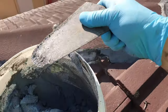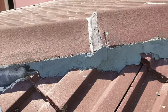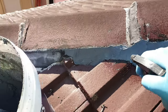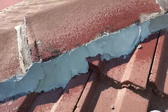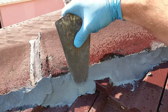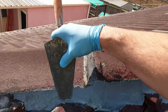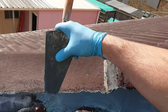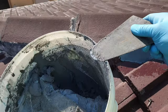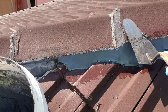After cleaning the roof and removing any loose mortar, apply the compound quickly over a 40 to 50 centimeter area. Then using a spray bottle with water, spray over the top of it and, using your clean pointing trowel, go over it again for a clean finish. If you don't have a clean pointing trowel you'll end up with a rough finish. These flexible roofing compounds have a workable time much less than plain mortar — that's why us DIYers need to use the spray-on water to get more workable time and achieve that high-end finish.